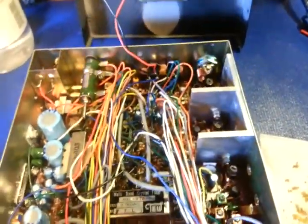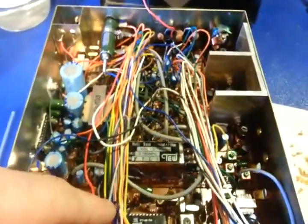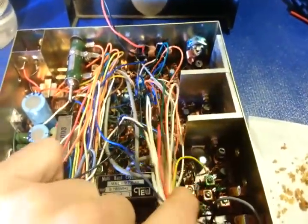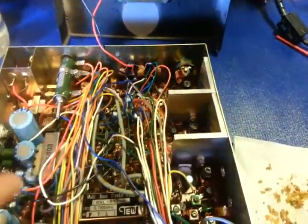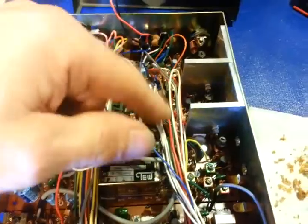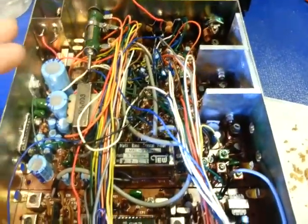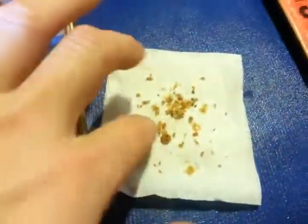Another thing on this — it has a couple of broken transformer cores. When the guy tried to do the 10-meter conversion, he tried to adjust some of these transformer cores. All of those are sealed — every single one in the VCO, PLL circuit, receive, transmit — every single one. Unlike a lot of radios where they'll just dab a little bit of wax on them, every single one was glued in with that same Sony Bond stuff.